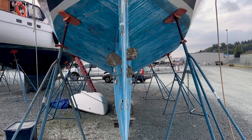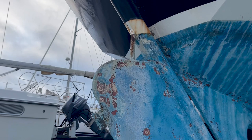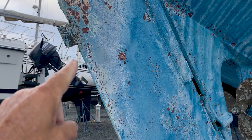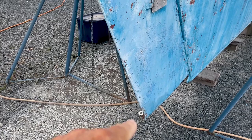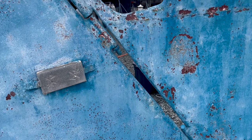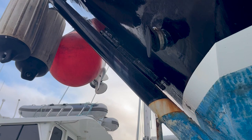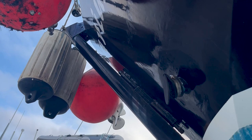This is the stern of the boat. There were particular questions about the rudder system. This one is set up with a Sayers autopilot system that fits into here and into another slot down here, and I believe that's up on deck. You've got a single point attachment point there, a long rod attachment point there, and then it carries on up to a long rod attachment point right there. The tiller obviously turns in toward the deck.